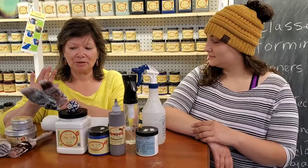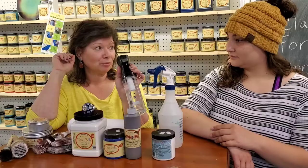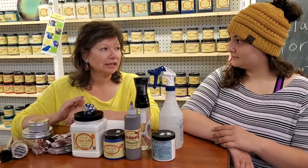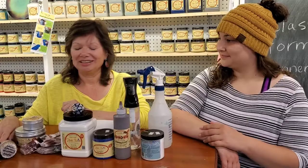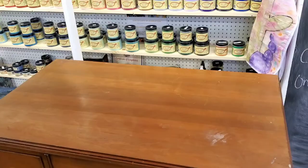We're going to need a couple of brushes because we're going to do a blend on the top. We'll use a few brushes and also a blending brush to blend those colors together — each brush for the colors and then one neutral. We're also going to use the mister bottle because this is kind of a drippy look, so we'll use that water to help the paint go down the front of the dresser. And when we're all done, we're going to seal it and protect it with wax — Dixie Belle's Clear Wax, and then a little Grunge Gray to give it some drama. We'll need a couple of brushes for those and some paper towels or rags.